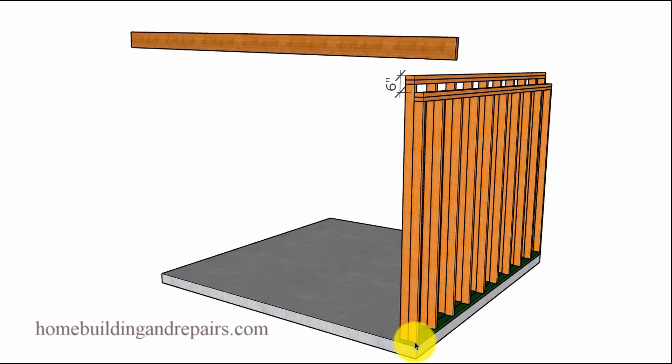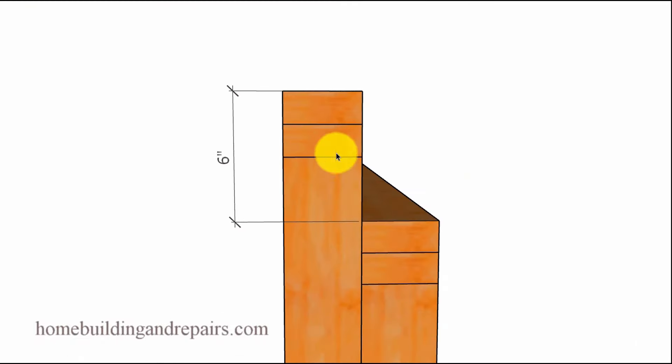The wall on the right side is going to be 6 inches shorter than the wall on the left side in our example. Since the span of the building is 12 feet, that's going to provide us with a half inch per foot slope. The minimum for this building would be a 3 inch difference in the walls, providing a quarter of an inch per foot slope. With a 12 foot span and a 12 inch difference in wall height, you would have a 1 inch per foot slope.